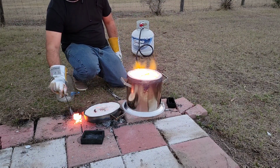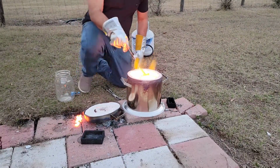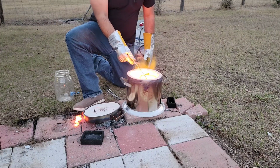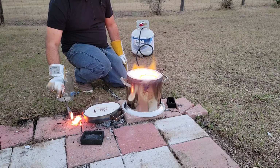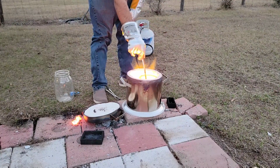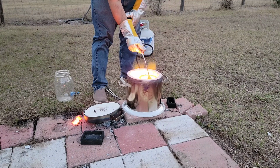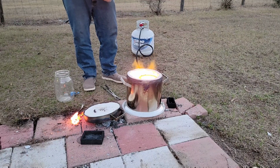This is just the first dip I've taken. There was a surprising amount of impurities in this copper. I mean, there's probably some copper in that slag I pulled off, but I don't want any risk to my purity of my copper bar. I'd rather have residual copper on slag than to have impurities in my pour. I think I've done 3 scoops of impurities out of this copper, and my glove is feeling like I have my hand trapped on top of a burning ember.